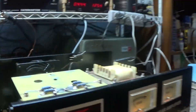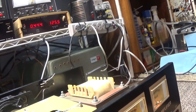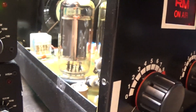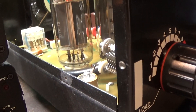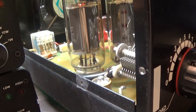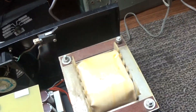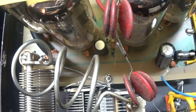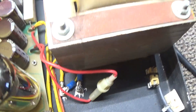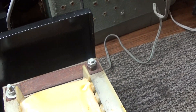One thing I didn't like about this amp was the case is painted and they use a lot of ground studs to the case, and you can't get good ground connections through the paint. That's a huge problem with this amp — bad ground connections. So what I did is on all the screws and ground connections I scraped off the paint, and now I get a very good ground connection. I actually added a few grounds on the pi outputs and inputs, and you can see the paint scraped off there.